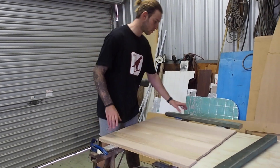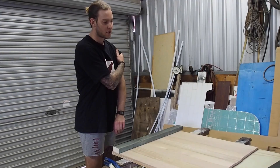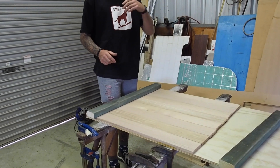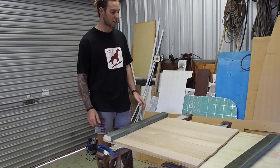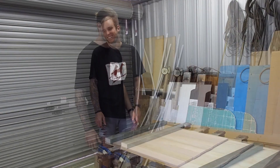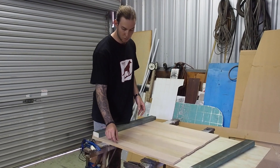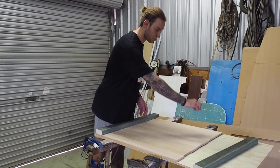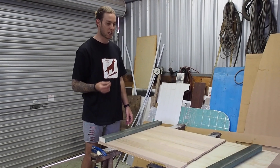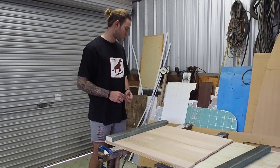What we're going to do is glue them all on and get these timbers across, clamp it and then squish it overnight, let it dry and then flip it upside down and use some bullet head nails to get it nice and tight. Once it's done we'll cut it to the exact size we want, put some 30mm by 12mm border around it, stain it, and then put a two-part clear coat on it to seal it.